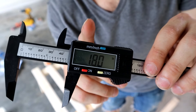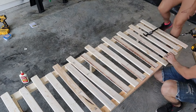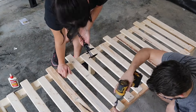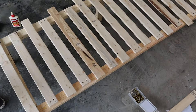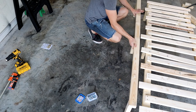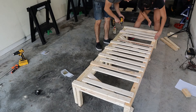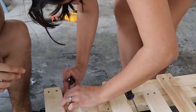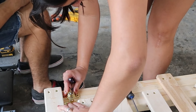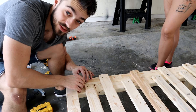We'll be doing 1.8-inch gaps between all the slats. We gapped out all the pieces of wood, only screwing down the ones that are not the mobile pieces. Then we set up the mobile piece — that's basically just the ledge. We screwed down all the mobile pieces, and this is going to lock the bed closed whenever we are not using it, like when we're driving. It's a clean way to do it as well.